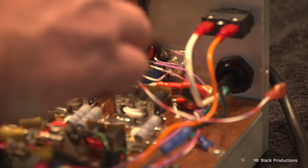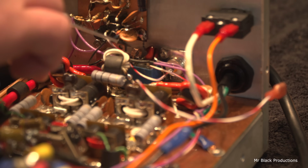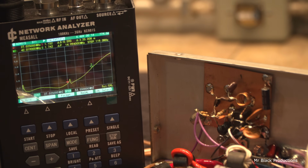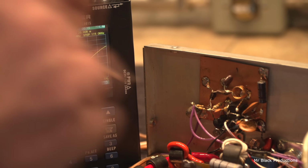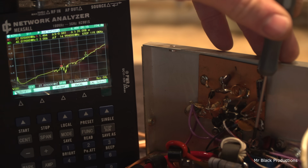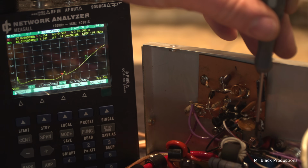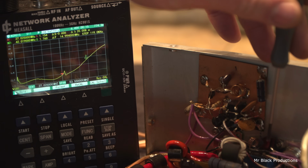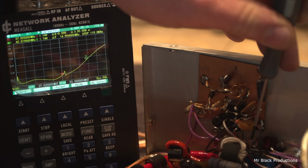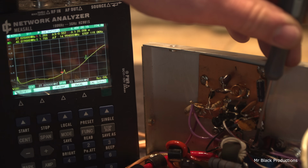Well, this thing is happy if I added exactly 40 pF worth of capacitance on the input side and then preloaded with the inductor coil. So we can adjust our input SWR, or pass-through SWR, by changing this coil. Check it out. That's me just putting the screwdriver inside the coil, touching it, pushing it closer together, or a little bit farther apart. See how that works?